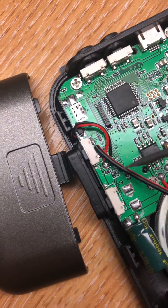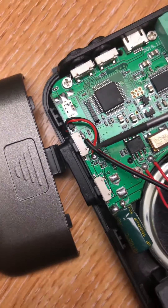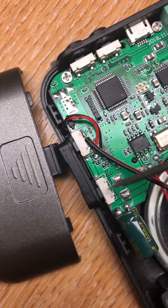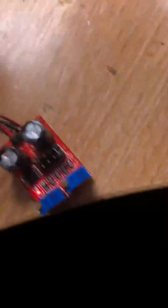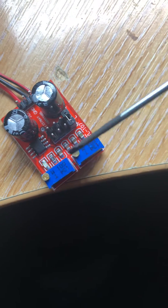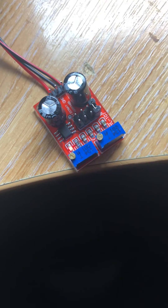If you want to be able to flip the scan, you just put a switch on this, widening the input. You put a wire to the top there, and if you've got a two-way toggle you can have a forward and reverse sweep. You can also adjust the sweep rate on these little pots here. Simple as that, thanks for watching.